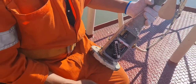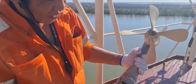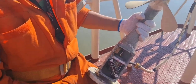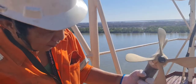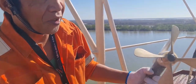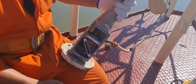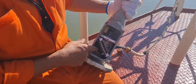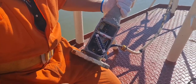It's only from east to west. We are working on a ship, that's why I said there's no north or south air, unlike maybe when working on an airplane. On the ship we are only concerned with port side, starboard side, and what they call forward and astern wind. So this is the function of the wind direction motor, or the servo motor.